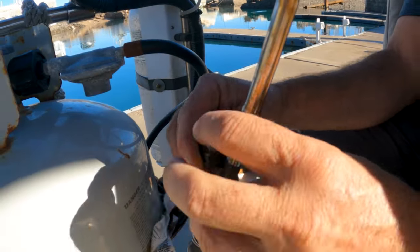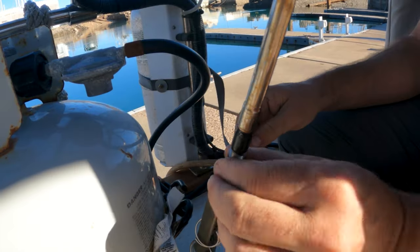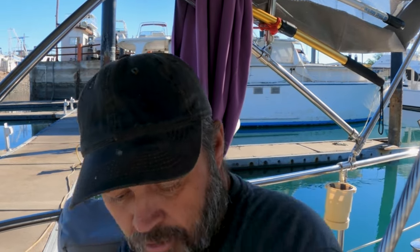I've marked the new position of our backstay — the top tape was the old position, the bottom tape is the new — and it looks to be about an inch and a half per side, which is three inches total, about how much we're going to lengthen this cable. So now we're going to loosen the backstay, take it off its chainplate, hook our halyard into our chainplate, tension it back up so the mast is solid, and Jessica is going to lift me up the mast to the top pin of this backstay.